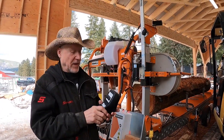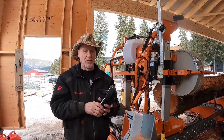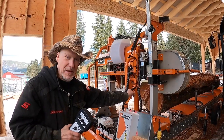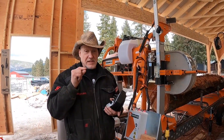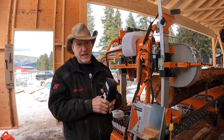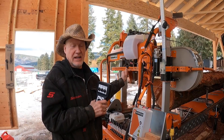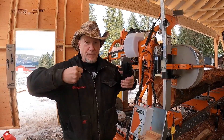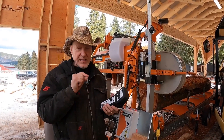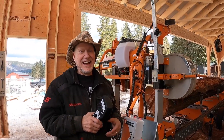And equally big win is in my saw head carriage control. There are three ways we can move this saw head down the rails. One is the way I've been doing it lately after the failure of the initial circuit board — take your grip, lean into it, and push the saw head down. Some context: there's this thing on these hobbyist sawmills with the narrow bands called blade shock. If I run this saw head too fast into the end of a log, I create blade shock. It's from no load to full-on load and full steam ahead, which is why I always ease into a cut. And that blade shock can cause premature blade failure, meaning it comes out the side of the guard mechanism quite unexpectedly.